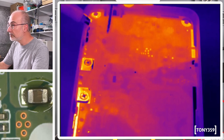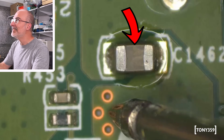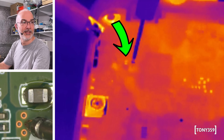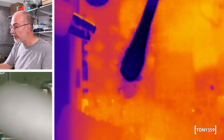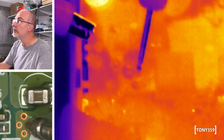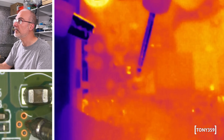So let's try more current or more voltage — 2 volts, 700 milliamps. There we go. The alcohol has evaporated. What about the thermal camera? Don't see much in there. It's interesting how the alcohol trick on this occasion has given better results than the thermal camera — I was not expecting that. With alcohol it's pretty obvious: injecting voltage, it takes a few seconds, and you can clearly see the alcohol evaporating from the capacitor itself. Fair enough, it takes a few more seconds than I thought, but there we go.